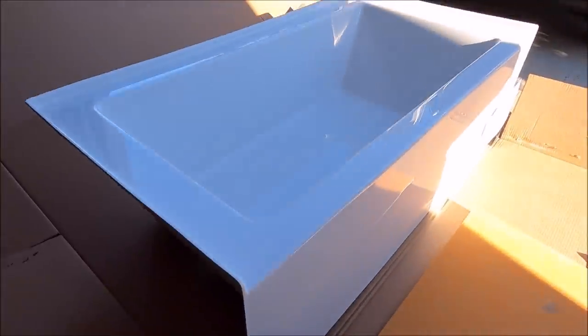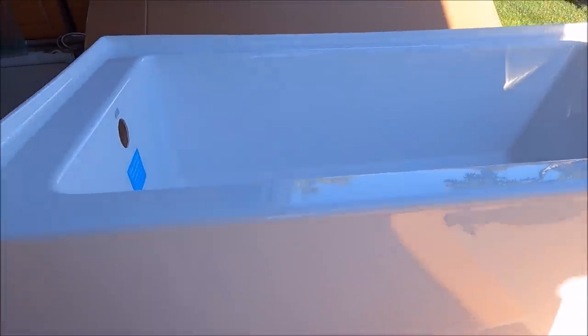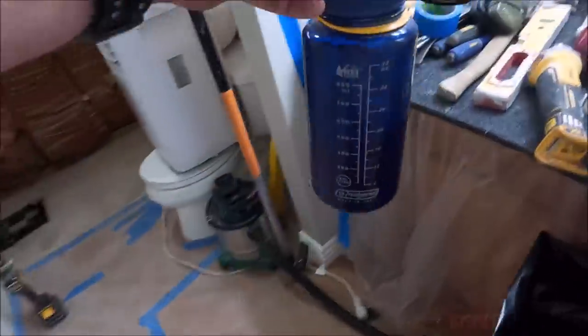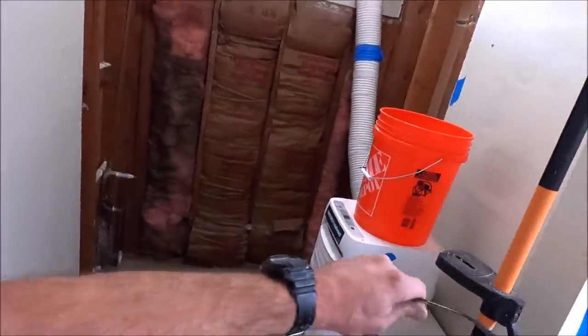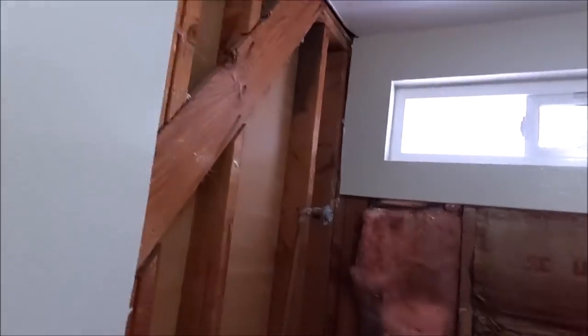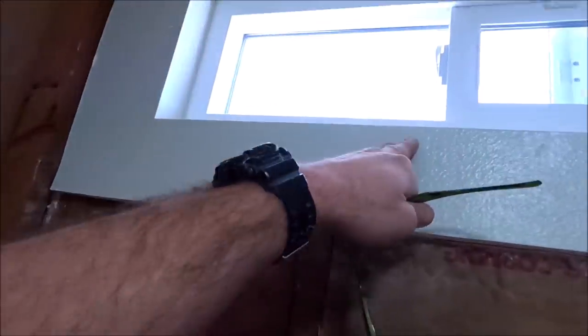This tub will sit in a mortar bed, tall soaking fiberglass. And here we are, folks. Laser pull ready for the laser. We have our air on. Everything's ripped out. We don't want to mess with this corner bead, so we are going to just simply wrap this with our Kerdi membrane.